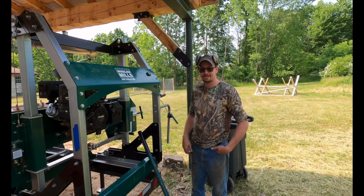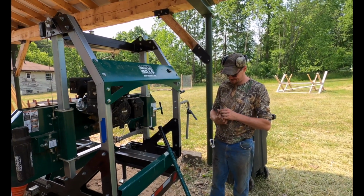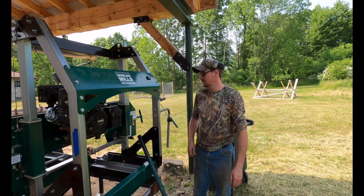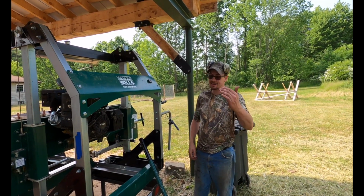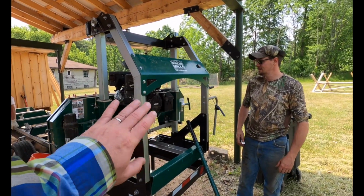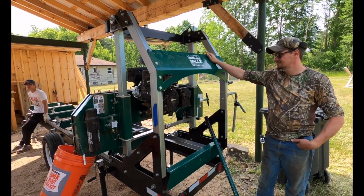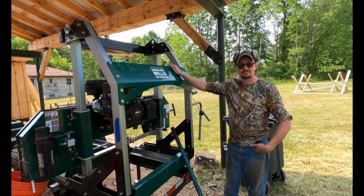Yeah, we juiced the engine a little bit beyond what is recommended based on Dan Reed's recommendation. At 4,000 RPM, it cuts better. 4,000 to 4,100, it cuts really well. I can do good cuts maintaining 3,900. When I start seeing that RPM drop down around 3,800, I know it's time. Now, I want to be clear, the engine's designed around 3,600 RPM. We upped it a little bit for the amount we use it. If we end up having to buy an engine sooner, then so be it. But the time we mill is less.